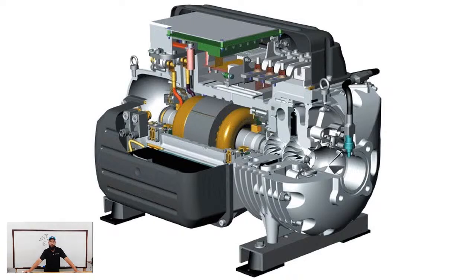Like my own team, all of us need to be hybrid techs. We need to work on chillers, and you need to be able to work on an RTU and everything in between. Even RTUs, Daikin is another prime example, like their Rebel series. They're running variable speed scrolls, and it doesn't look like what we would think of as a VFD, but there's a small little green board on the side of that unit, and that is the VFD for that system. It's got capacitor banks, it's got an internal inverter, it is a VFD. It doesn't have an interface, and it doesn't look like it's in a pretty case. Aeon and a lot of those types of systems are putting actual VFDs on compressors. So now's the time, guys.